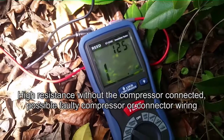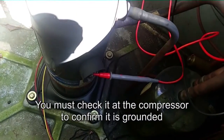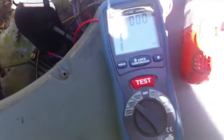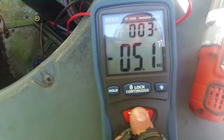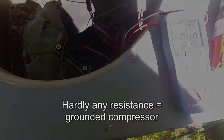Looks like that's what it is. Let's go to the compressor itself. Looking down in there at the compressor, we have one wire on one of the compressor terminals, the other one is clamped on to my copper sensing tubes. Nothing - she's dead.